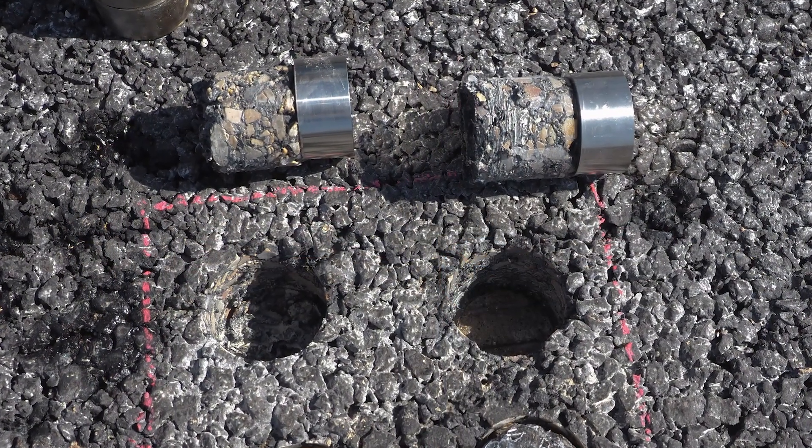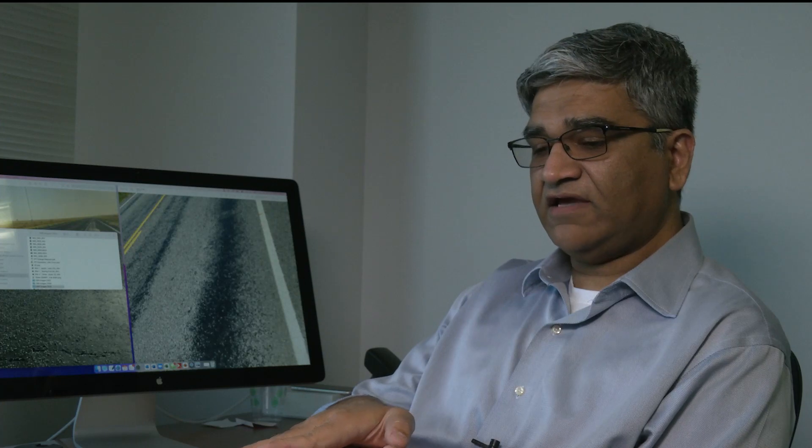For this asphalt to work properly with the underlying concrete pavement, you apply a layer of tack coat, which is kind of a glue that bonds the top asphalt layer with the bottom concrete layer. Occasionally, if the surface texture of the underlying layer is not good enough, or if there's moisture or dust, or the quality or chemistry of the tack coat is not appropriate with the concrete surface, you don't get good adhesion between the tack coat and the concrete or between the tack coat and the asphalt above it.